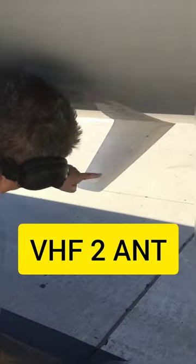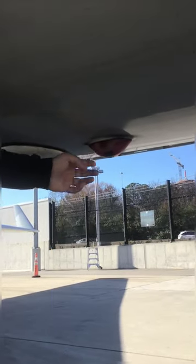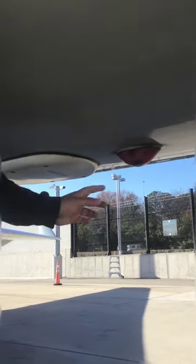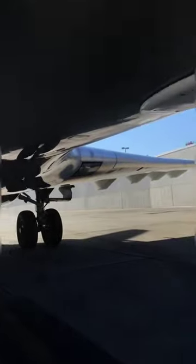Your VHF antenna is more prone to getting damaged — make sure it's secure, give it a shake and inspect for cracks. Your Mylar — everything's looking good. Your antenna, your beacons — we'll check the beacons when we're up in the cockpit, but down here we're just making sure it's not cracked. Here's your ADF antenna — this is what they call the ADF antenna. This is your anti-collision light, lower beacon — make sure it's not cracked, no burn marks. We don't usually have problems with the ADF antenna.